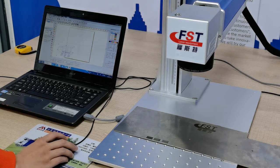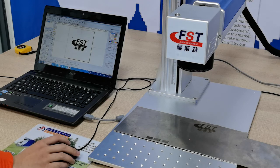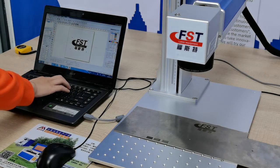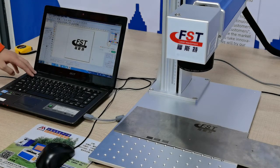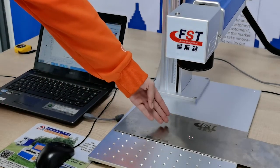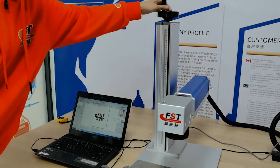Click the Apply button, then the Origin button again, and then the Hatch button. Make the necessary parameter settings and click OK. The logo is now filled with black color. Set the speed to 800 and the power to 70%. Now it's ready to work. Then we have to adjust the focus lens — switch on this button and you can see three dots on the work table. Adjust the handle lift to make the three dots come into one dot.